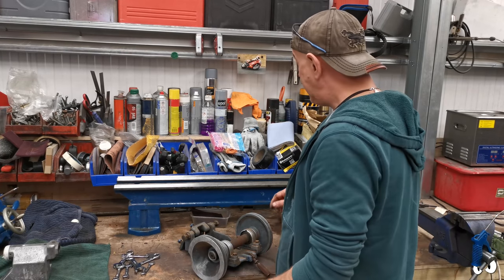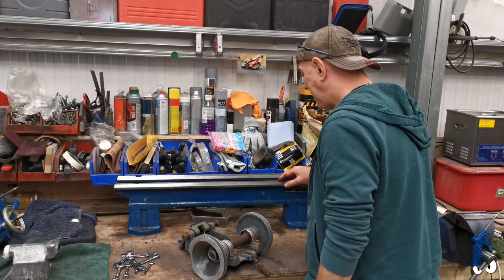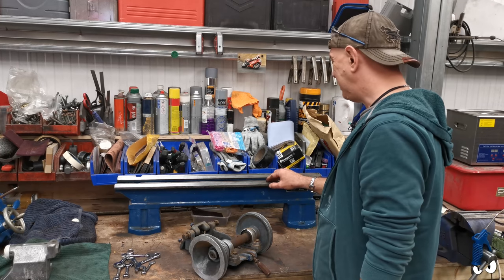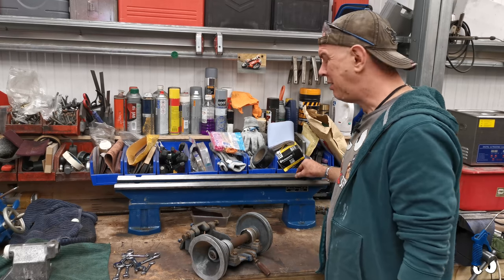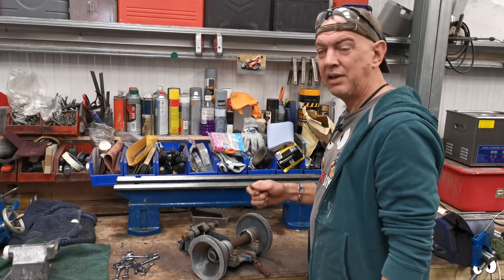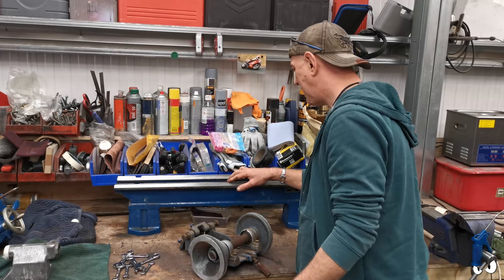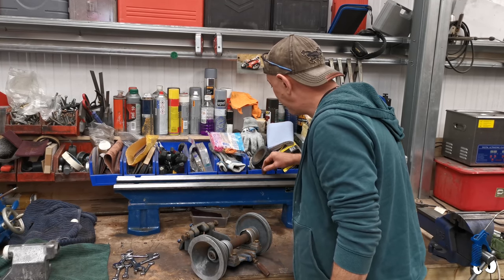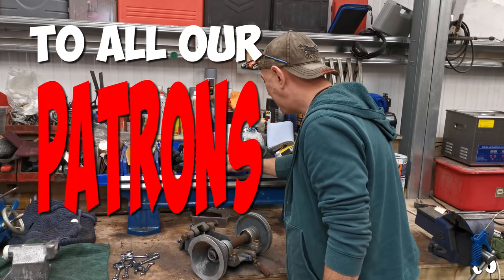The ways, I've scrubbed them. They've been de-rusted with that Evapo-Rust stuff, which is really, really good actually. I did it with t-shirts and stuff in the end, much better than using paper towel. And then it's had 3-in-1 all chucked over it and just gone over it again with a Scotch-Brite just to take the schmoo off. There is a little bit of discoloration, don't really care. And if you run your finger along it, there are a few little pits and stuff. I think it could have been where the rust got to it. I don't really know.